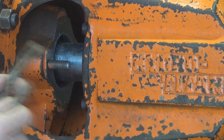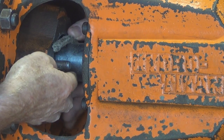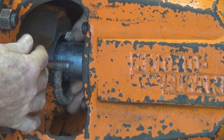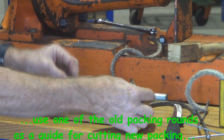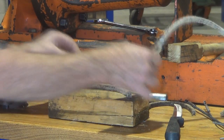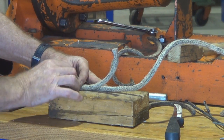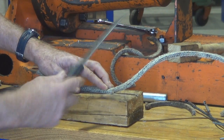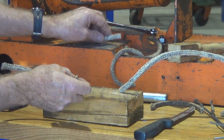Now what we've got to do is make up some new rounds of packing. I'm going to use one of the old rounds — it's important that when they fit in you have a nice neat butt-up on the ends so that there is no path for leakage. I'll use one of the old pieces of packing, pull out the new packing, lay it along the length, measure it with that old packing round, then with a nice sharp knife just slice it through to give a nice square end. I need to make up seven rounds.